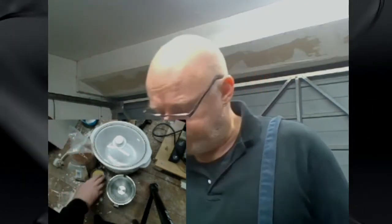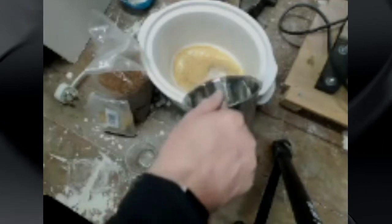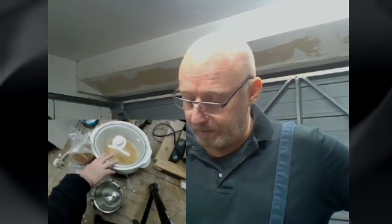We need an animal glue. In this case I'm going to use rabbit skin glue — that's this here. No matter which glue you use, you will mix them one to ten: 50 milliliters of glue, which comes in these little granules, and 500 milliliters of water. This needs to soak for at least 12 hours, ideally 24 hours. We'll be coming back to it tomorrow, but while this is going, let's talk about glue.